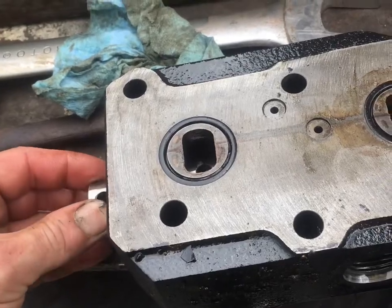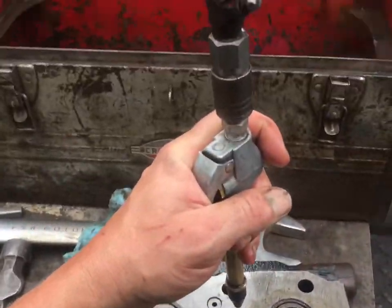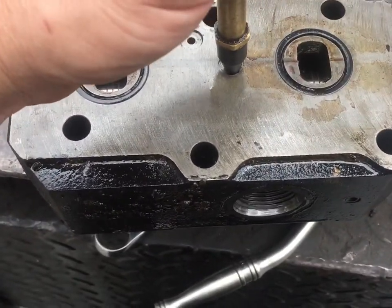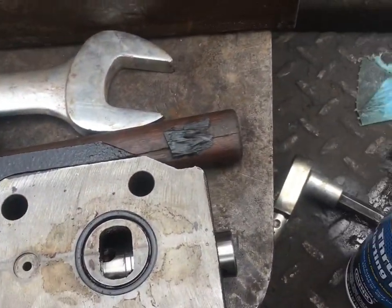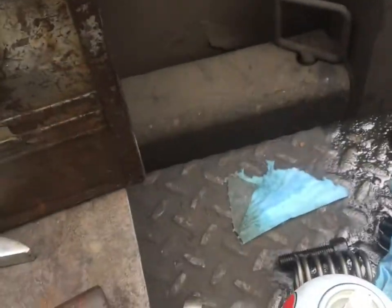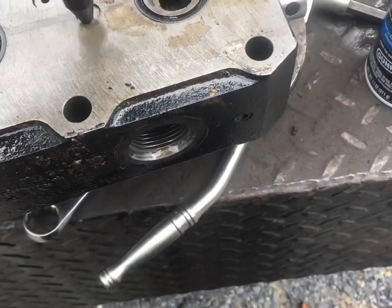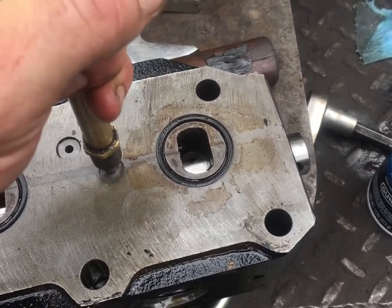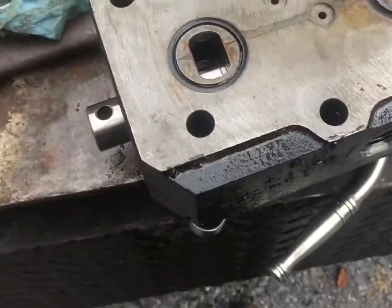The spool is floating free and I don't see anything obviously wrong with it. Let me shift it and give it some air — air comes out this port when I blow in here. If I shift it the other way, it blows out a different port. With it dead centered, it comes out the port right in the middle. So this port checks out as our motor brake port.